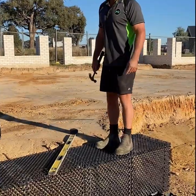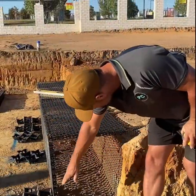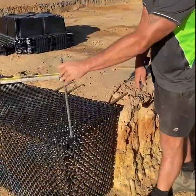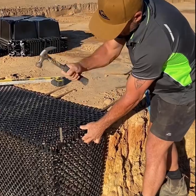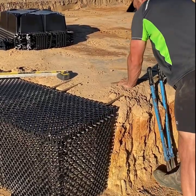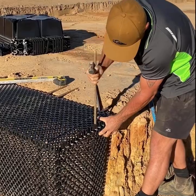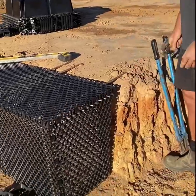As you can see, not like the pods — this is stable, safe, and a good environment to work on. Put this hole to fill in so the concrete doesn't fill in there. Same principle: measure it up, cut it, put it in there, pin it. We'll get that to work. We've cut it, we've blocked the hole up and now we've put two pins down there, like so. And that's all blocked up.